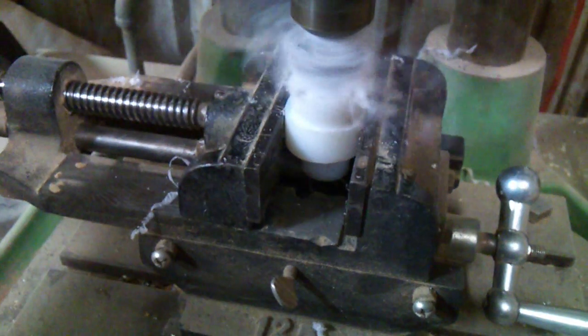The Delrin will actually compress, so you have to be careful about it. I had a misfire earlier when the bushing decided to take up and leave the vise. So I'm slowly going down through this to get all the material out.